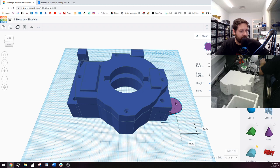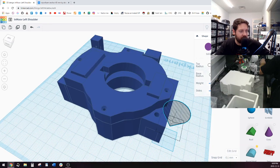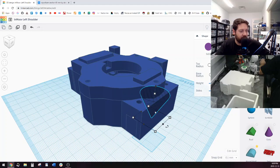So the foam manufacturer, or contractor I should say, they're actually going to put a layer of coating and a layer of paint on top of the coating for strength. And I don't know what material they're using. It might be like an epoxy, but that's what they're going to do to strengthen it up. And that's what I feel will likely help out the design that I'm thinking about, where we'll have the 3D printed anchors underneath that coating and have, you know, a screw sticking out so it doesn't get filled in. And then we'll remove all the screws and then the anchor should be locked in the coating and not move.